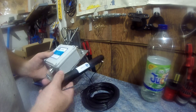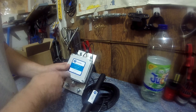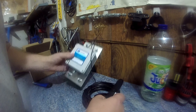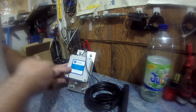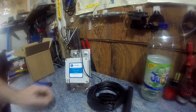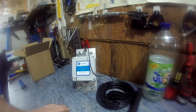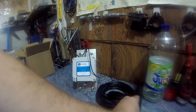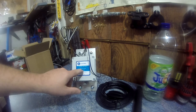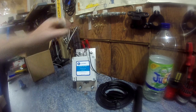If there's continuity on the outside shield of the plate, then I know it needs some form of ground or counterpoise. If there's no continuity, it's designed not to have it. What they do is tune each one to 80 meters, and the rest of the bands they tune on the bench before they send them - all personally hand tuned. Looking at the instructions: it's the multi-band 80, 40, 20, 15, 10 - approximately 23 meters. It's got the connector there with a nice bit of reinforcement to take the strain and a PL fitting.